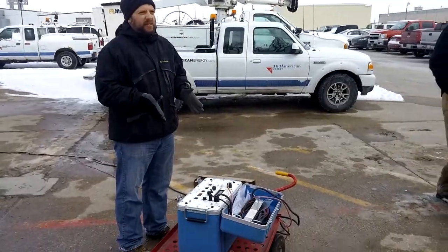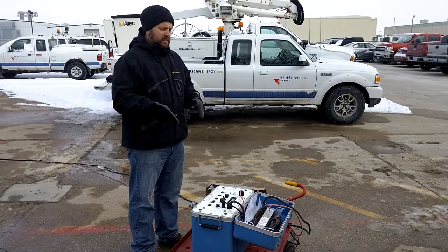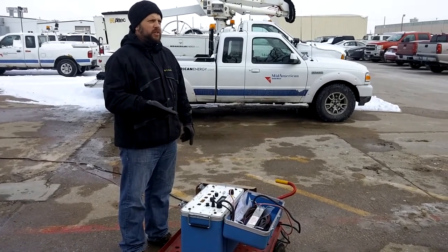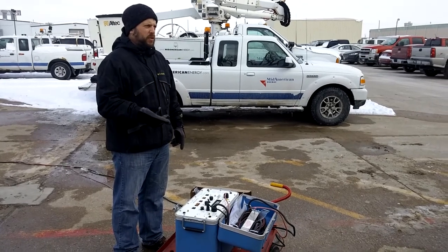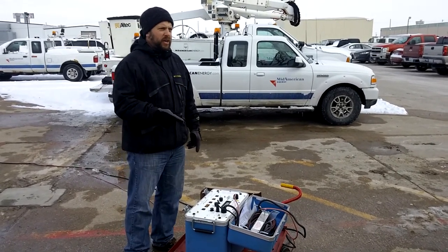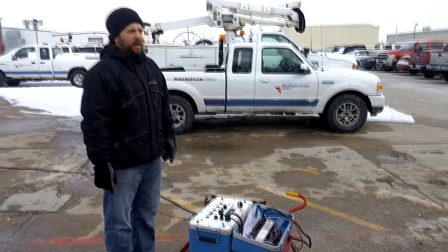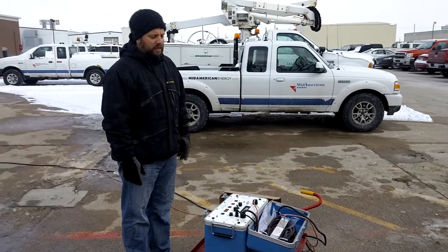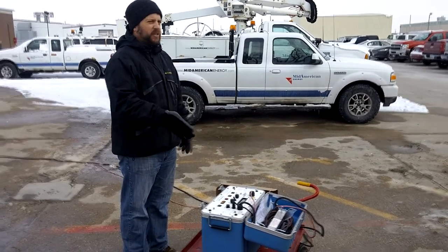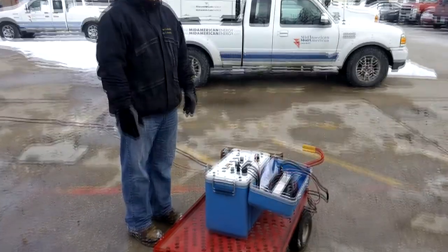What we've got here is a 10 kV thumper and it's all self-contained. It's 55 pounds, but it has a battery inside of it that's 24 volts. When it's fully charged, you're at about 26 volts. It's a lead acid battery, so it's alright to go ahead and leave it plugged in. There's a little regulator that will keep it fresh. The battery itself will last about an hour's worth of cycle if it's a good new battery.